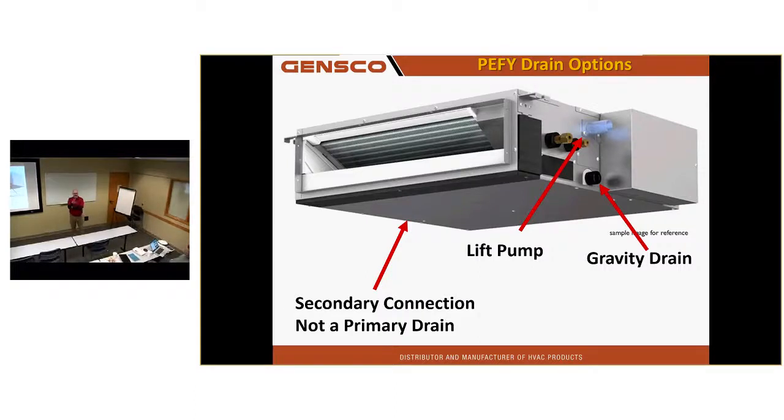Can you read the nameplate to me? Well, yeah, but I gotta turn my head upside down. You can't put the cover plate on that electrical panel upside down. It only goes on one way, so if the lettering is upside down, so is the unit. This call actually comes in about every 2 weeks at tech support, where one of these units is upside down. You guys gotta put a bottom, this is the bottom. We need an arrow pointing up, up.